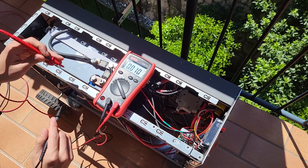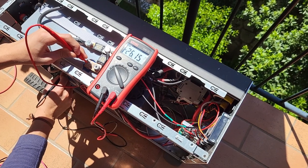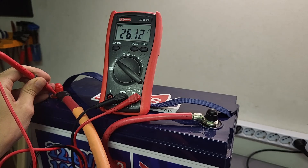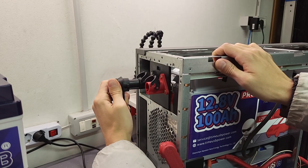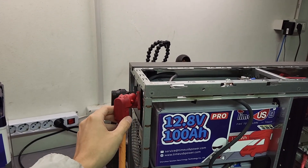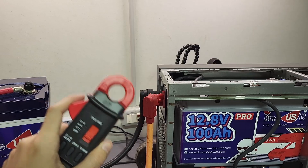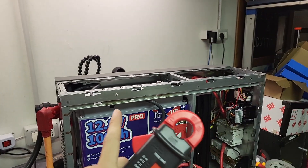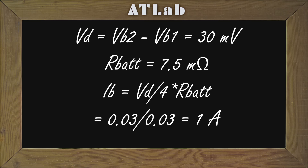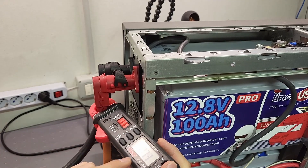A few minutes before, I charged the battery pack using the solar panel. Now I check the voltage and it reads 26.15 volts, matching the two batteries in the garage. I check both packs and their voltage difference is only 30 millivolts, so I connect the negative terminal and triple-check — still 30 millivolts difference between the two. Moment of truth — I'm really nervous here. If I made a mistake, sparks will be everywhere. I keep the current meter ready to monitor current flow, and the inverter and charger are completely disconnected.